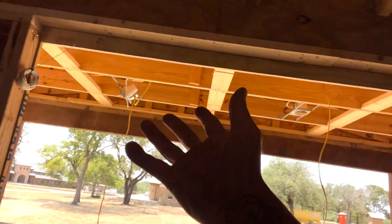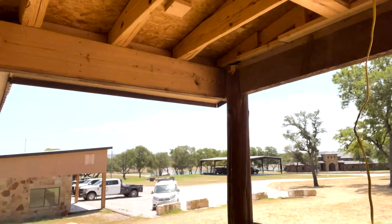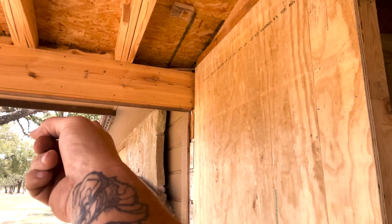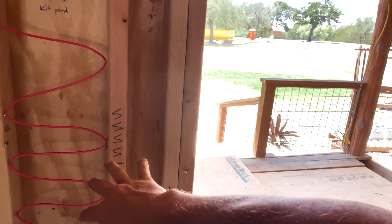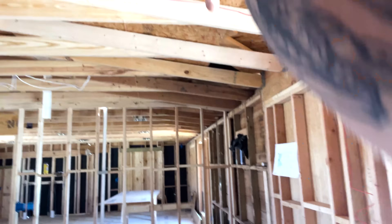Out here I know there's going to be some lighting. They're probably going to have some sconces on the walls, maybe a low-voltage stub over there, some soffit lights, something like that. So right here I'm probably going to have a four-gang. I marked exterior sconces, exterior cans, kitchen cans controlled right when you walk in this door, kitchen pendants if they decide to do an island, maybe one row of general lighting and then something over all the kitchen stuff. It's just figuring things out — looking at the space and thinking, if I lived here, where would I want things? You have to walk through a place to figure all of this out.